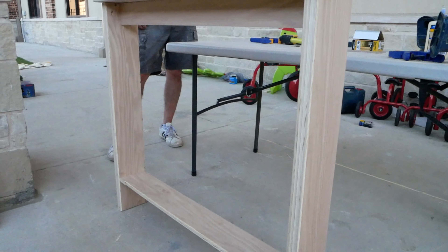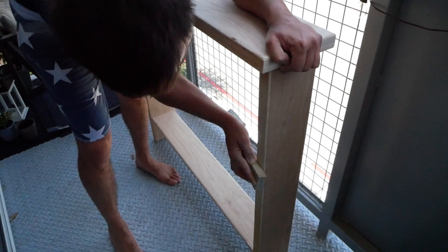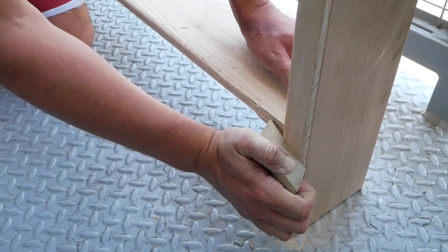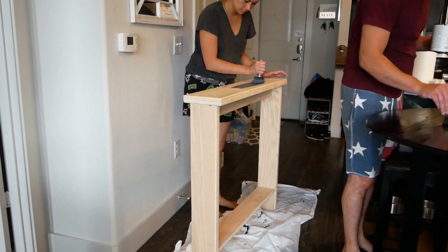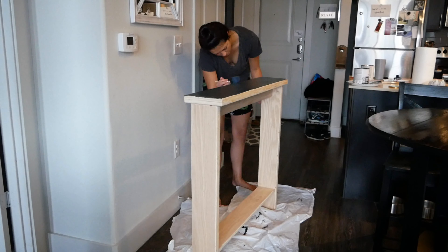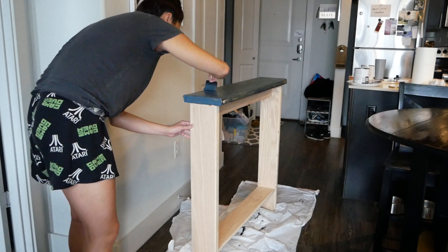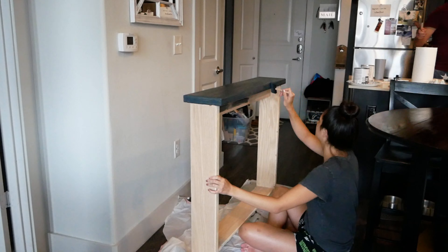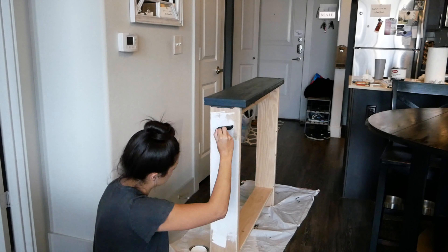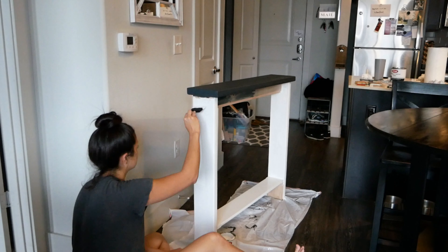It's all done! This is exactly what I envisioned when we started making this, and it's just so cool to have a piece of furniture in our house that we made from scratch. Chris thought that filling in the holes with wood putty would help but unfortunately it was kind of a pain. Luckily we borrowed David's power sander again and it worked out just fine. We got these two chalk paints from Lowe's — I think they're about $10 each. Chris is painting the top of our kitchen table; it got damaged during our move but now it looks as good as new. I used foam brushes instead of horsehair because it helps with paint streaks so it looks a lot smoother. The chalk paints actually dry pretty quickly so it didn't take very long to cover the whole thing in a couple of coats. When it dries it's got this really pretty matte powdery finish — it looks super cute and farmhouse-y, which is just what I was going for.